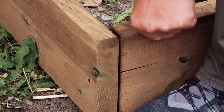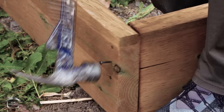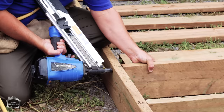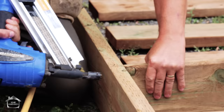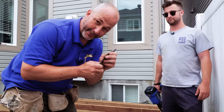The rule of fasteners: you want one fastener for every 2 inches of dimensional lumber. This is a 2x8, so it gets 4 nails. Matt's using 3¼-inch nails from the nailer — they're a little smaller than a hammer-driven nail, but they're hardened steel and carry the same structural load. If you want to build it quick, the nailer is definitely the best option. Keep your hands far enough back up the board when nailing so you don't hurt yourself.